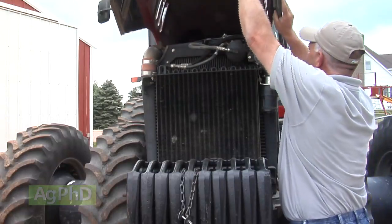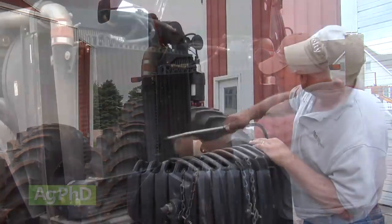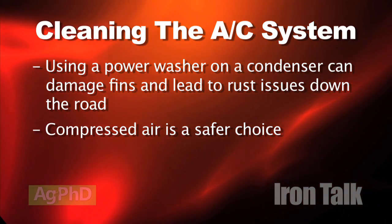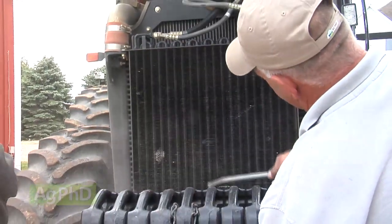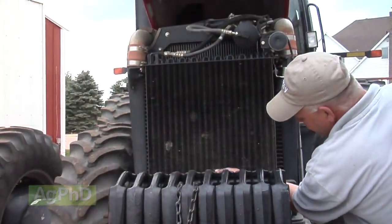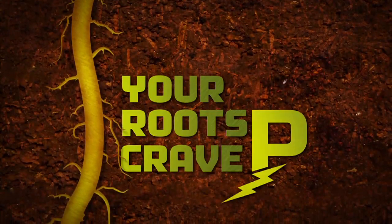Temperatures in the 70s may be all you can expect inside your cab on the hottest days. If your cooling system isn't even achieving that, then you can turn to maintenance items that may improve performance. The one thing I would look at is the air conditioner's condenser — watch for bent or dirty fins. Depending on the make and model of tractor, inspecting the condenser may be a simple job. If cleaning is necessary, use an air compressor rather than a power washer — high pressure water spray can easily bend fins, which adds to more problems, and water can build up leading to potential corrosion issues. Keep in mind your air conditioner can only take about 30 degrees off the ambient air temperature. Check the condenser and then call your local equipment dealer for more tips on keeping your tractor cab cool this summer.